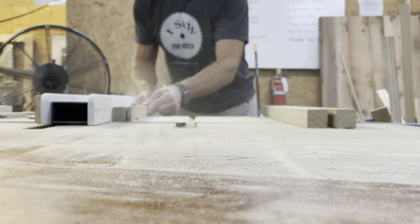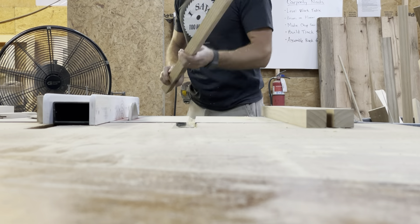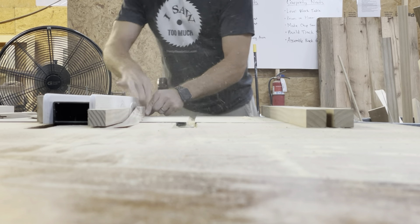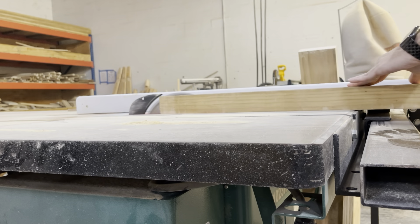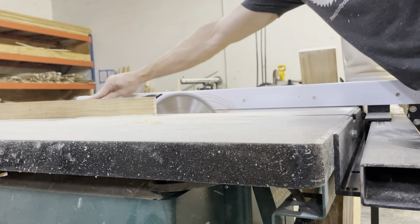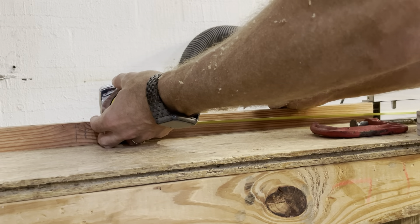My supports were one-and-a-half by one-and-a-half boards of the Akoya. These were going to be inside the garden bed, so you wouldn't really see them except the tops poking out a little bit, so I just took some scrap wood and milled it to the right size — that way we're not wasting anything. The body of the raised garden bed was going to be larger pieces, essentially two-bys: one-and-a-half inches thick by five-and-a-half inches wide. I had to mill these up, get them nice and smooth on the jointer, then the planer, and then the table saw.